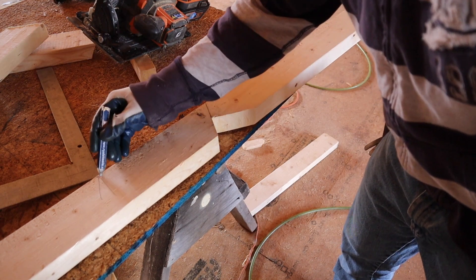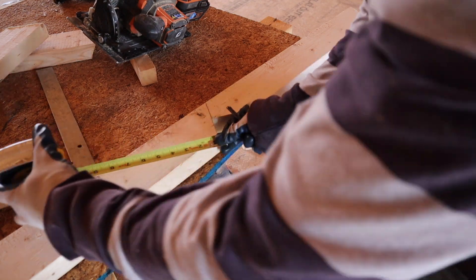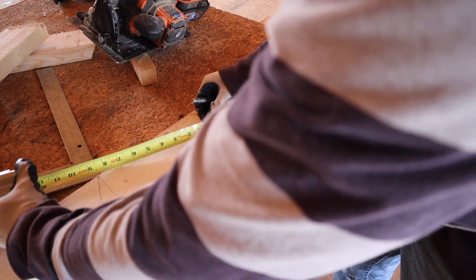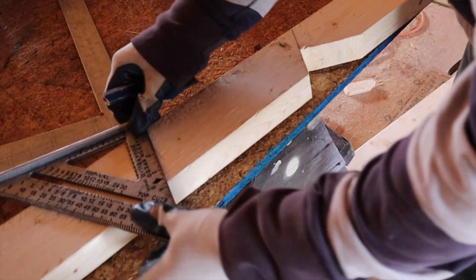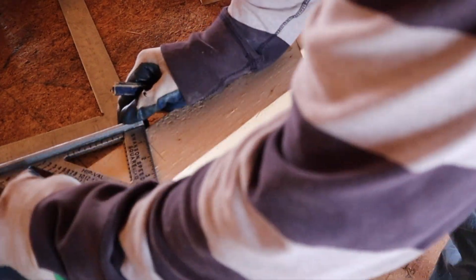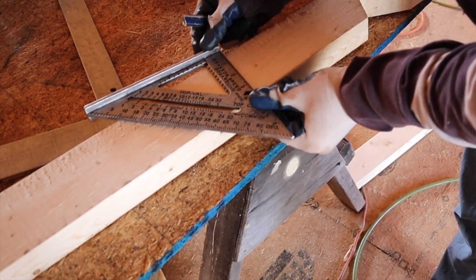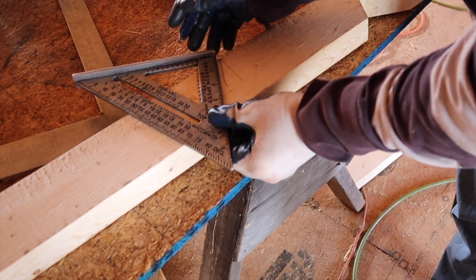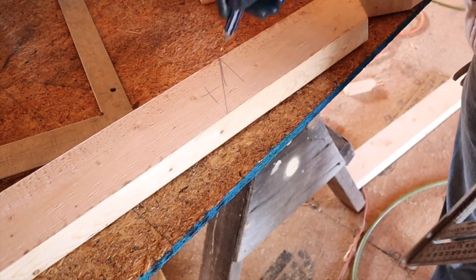From this point to this point, once it's set up where it's supposed to be, it should be eight and a half inches — pull your tape to double check. You can use that tape method too, but sometimes you get off a little bit, so this is the best way I like to do it. Once you've got your mark, put your 7/12 on it using the common side of your square — there's your seven — and scribe your line, then cut that off.